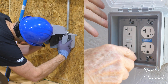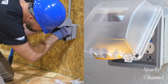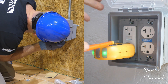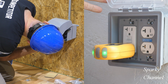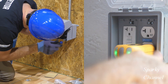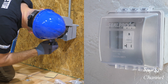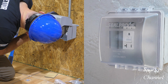Now he's going over the reveal — he wants the receptacles to align perfectly. He has his receptacle tester in the GFCI receptacle and he's just turned on the circuit breaker. There are two green lights, which means correctly wired. The GFCI test passed, and now he's going to test the standard receptacle — it passed regular wiring and it passed the GFCI test. Sparky's done.